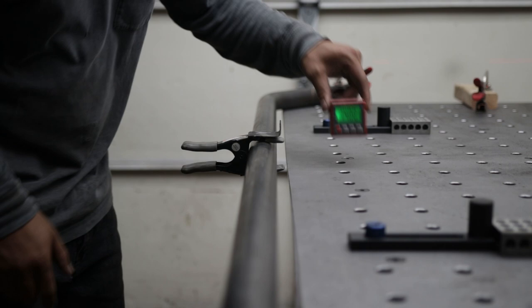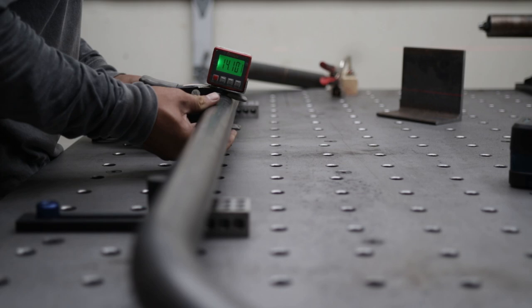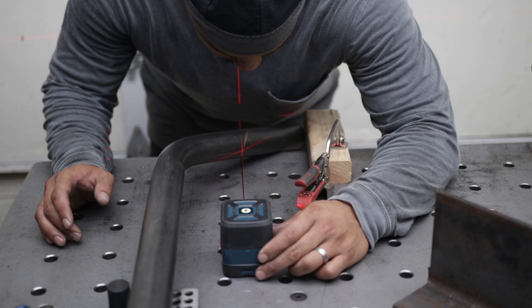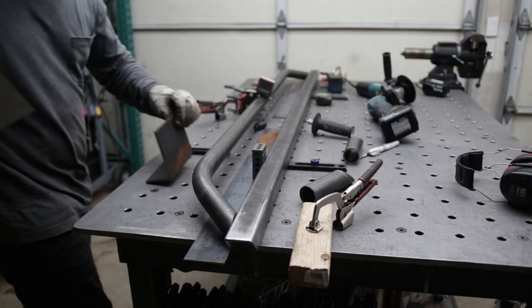Next was to add the 20 degree kick up and trim the bent ends. I used my table dogs to get the tube aligned and slid a tape measure underneath until it was close enough. To make it easier to trace where I needed to mark my trim ends, I used a laser level as a guide. After the ends were trimmed, I checked to make sure the spacing was the same from front to back.